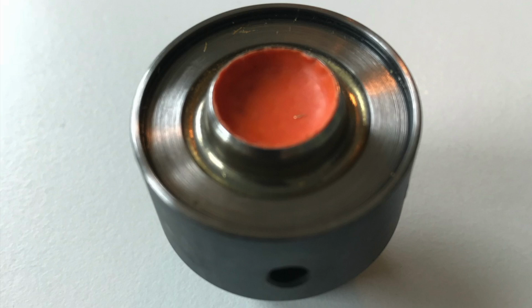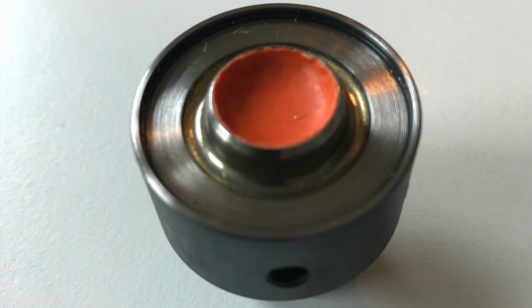As we proceed to calibrating the position of the bottom die through a series of test cuts, it is important to emphasize that you can break the blade, ruining the bottom die, by doing this procedure incorrectly. Pay careful attention and you'll be making great cuts with just a little effort. With the die in the current position, connect the machine to electricity and turn it on. For the remainder of the die setting procedure, we are operating the machine without the front safety cover on. This is to provide the best possible view of what is happening.